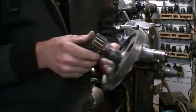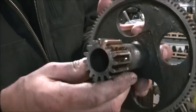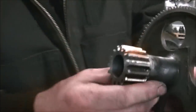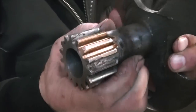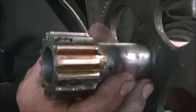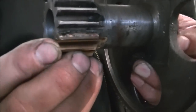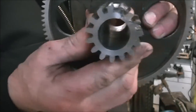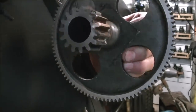I set the tool up between some of the existing good teeth and set my dial indicator so I knew how far to feed to get to the root of the tooth. Here's just a sped-up clip of the process — I probably could have gone a lot faster but it was my first time trying anything like this, so I took my time. After a couple passes, got the tooth to depth, rotated it, and finished it up. Here's the finished product. I was real happy with how things turned out. There's a little bit of braze visible, and now that I look at it, I kind of wish I'd brazed up the whole thing and recut all the teeth, because there is quite a bit of wear after a hundred years. If I notice it being a problem when I get it back together, I'll just braze the whole thing up and recut all the teeth. Thanks for watching and we'll see you on the next one.